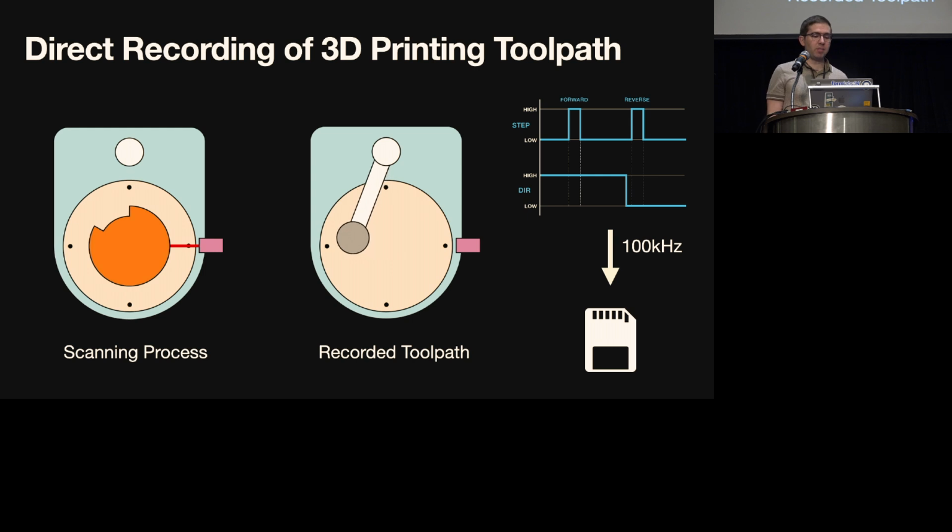In order to maintain compatibility with the DPW control system, we directly record the scan data not as absolute coordinates, but as step direction motion streams comprising the printed toolpath. This format introduces some interesting challenges. In order to convert scan data into recorded toolpath motion streams on the fly, the process happens at a nearly constant linear print speed rather than a constant rotational rate.